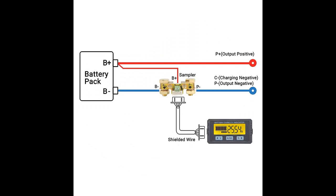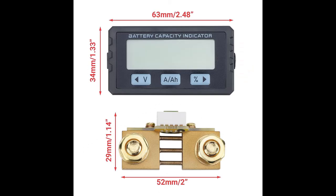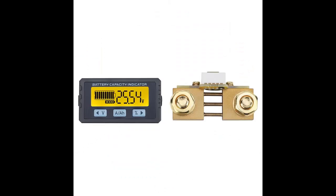Highlight Features or Overview Summary includes: DROK Battery Charge Discharge Monitor is suitable for any kinds of batteries — 8 to 120 Volt, including 6, 12, 24, 36, 48, 60, and 72 Volts. Compatible battery types include Lithium Battery, Lead Acid Battery, Lithium Iron Phosphate Battery, NIMH Battery, and others.